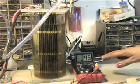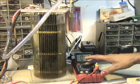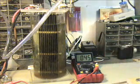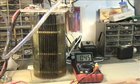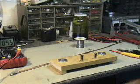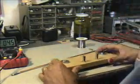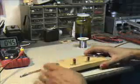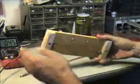The amperage on this is taxing this meter. This meter is good for 20 amps and I'm getting a lot of overload on it. I don't want to burn it up, so what we're doing is we're going to make a shunt — a poor man's shunt created with a piece of wire and a piece of wood.